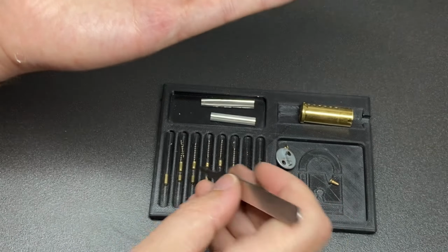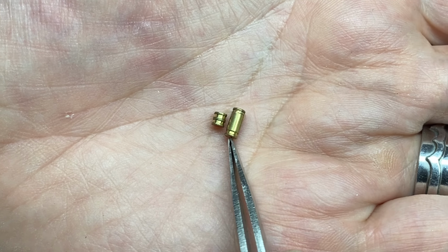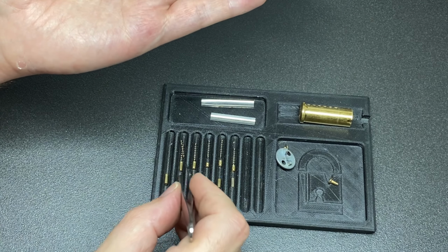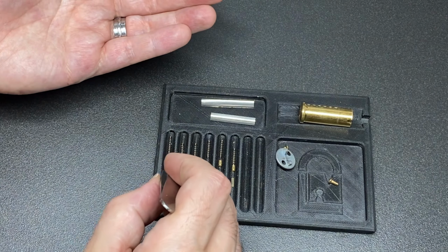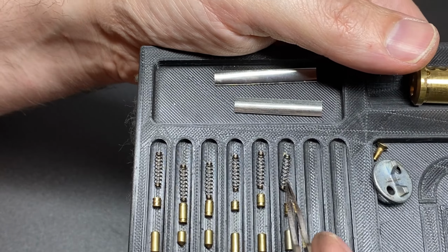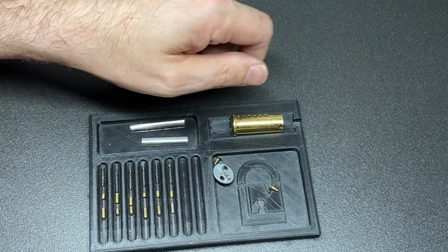The pins are very, very cute. I'll get a long one and a short one. Look at these very sharp lipped spool pins. Very slight spools, so they feel a lot more like serrated pins. Very similar to the feel of what you get in an ASSA lock, like the, was it D12, something like that? Yeah, these are very ASSA-like spool pins, and quite tricky. Lots of little clicks, feels like serrations. So yeah, that's the Tigris Omega. Very cool.